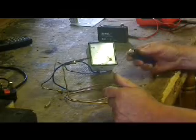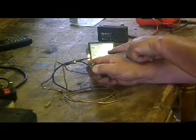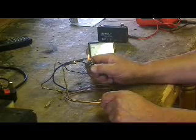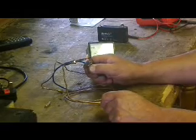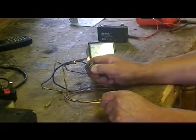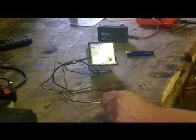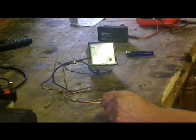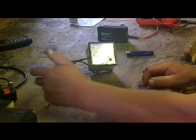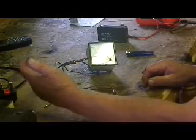So we'll just simulate a pilot light here. When the pilot light's lit, see that little needle — it should go up to about 18 to 20 millivolts, which it is doing. It's up to 18 now, going to 19 — well that's about all you'll get really. And once we let that go, it'll fall down. Now once it falls down to 10, you'll hear a clunk in your gas valve, and that's because the electromagnet can't hold it open any more as it hasn't got the right voltage — it will clunk and then the gas valve is shut.